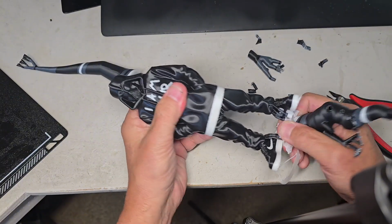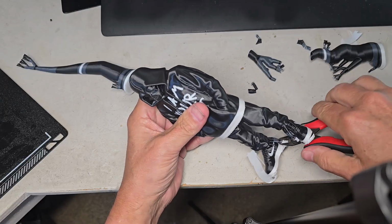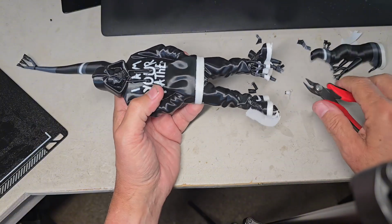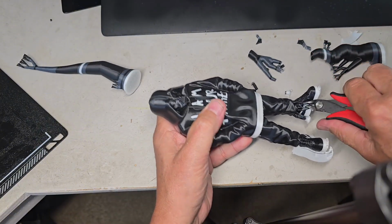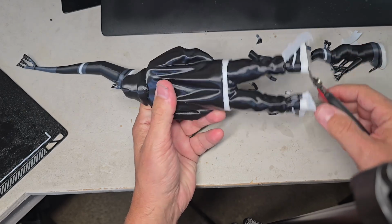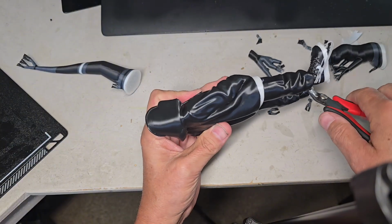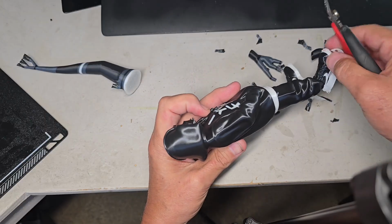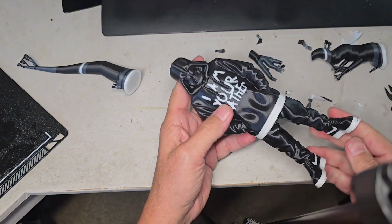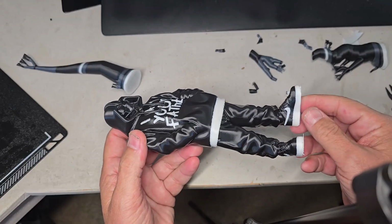One thing I did change, as I mentioned earlier, is I changed the infill pattern from gyroid to adaptive cubic, because I've read and actually experienced myself that gyroid doesn't like to print well with tall objects or tall models. And you saw that was the case for this, but yeah, that's pretty awesome. Darth Vader in a sweatshirt with Nikes on.